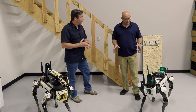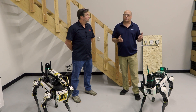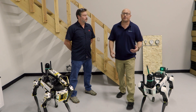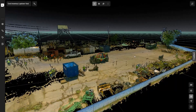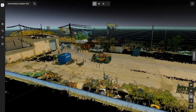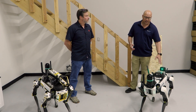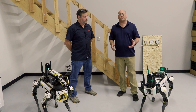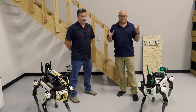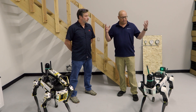What we're showcasing here is really the opportunity for creating digital twins. The technology has cameras on the front with the LiDAR scanner, so you're quickly able to create a colorized point cloud. What we really like is the ease of use — we were able to make scans within maybe 15–20 minutes, do the processing, and share that data within an hour. The new GNSS puck and RTK capability is going to open up a lot more outdoor use, since SLAM LiDAR has traditionally been used indoors.